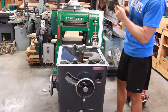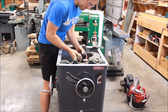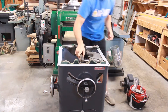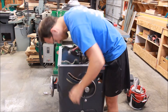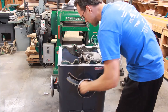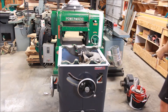And so there you have it — arbor reassembly. Now reinstallation. We've got the keyed shaft and again a little machine oil to keep everything nice and smooth. I'll put the key in the keyed shaft. I pulled the motor bracket up so that this arbor bracket can get into position and does not hit the front trunnion bracket. I'm going to work my way on here and then use a wooden block and a hammer. Checking to see that it's aligning with the worm gear properly, and making sure it moves smoothly through the full range of motion. Now it's about time to put the top back on.